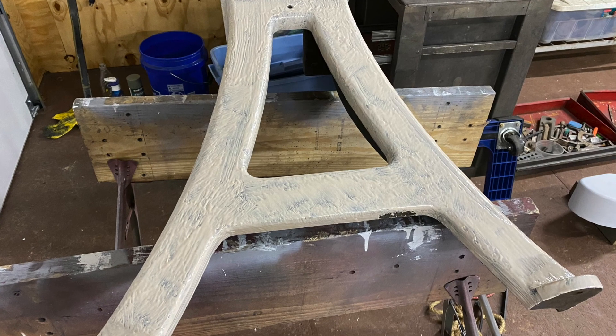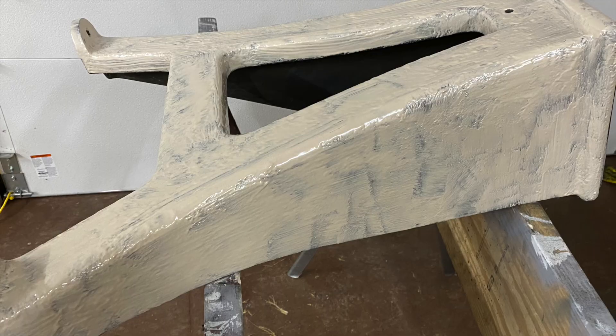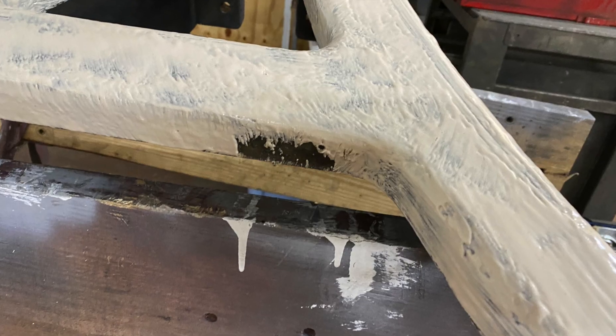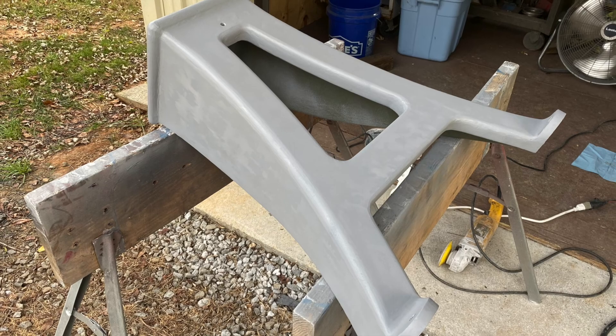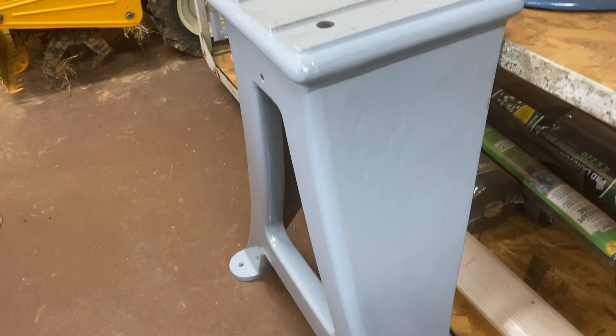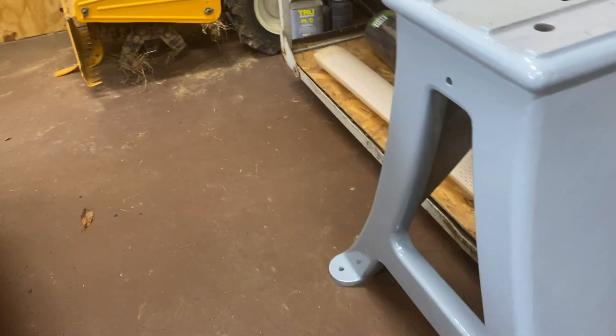Okay, last thing. Just wanted to show how I smoothed out the casting for the legs. I used the Bondo liquefied with epoxy resin, although I later decided I don't like the epoxy resin, but that's what I did here. I sanded it off, looking smooth, and painted it. This leg I'm fairly happy with — I can see some imperfections there, but I think it'll be okay.